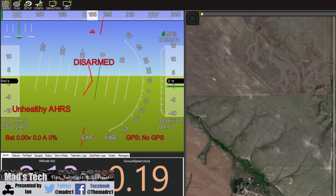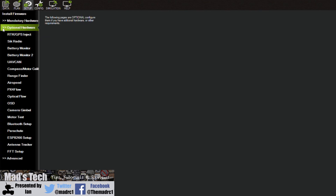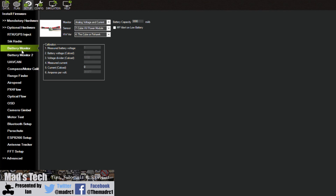You will need to configure the sensor in Mission Planner if you're using ArduPilot. Take the information from the little sheet of paper included in the box and configure that in the battery monitor settings. To do this, go into Setup, under Battery Monitor under Optional Hardware. Configure it as a voltage and current sensor, then change the type to a standard power module which is 'Other'. In here you set the voltage divider calculation and the current ampere per volt as per the sheet they've given you. This will give you the correct reading in your autopilot software for current and voltage — you don't need to do any further calibrations yourself. Simply put in the pre-calibrated values and you're ready to go.